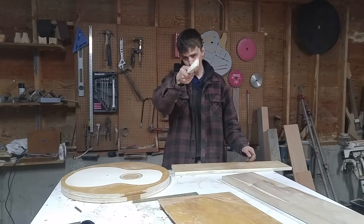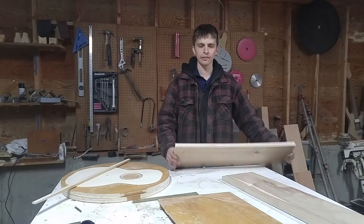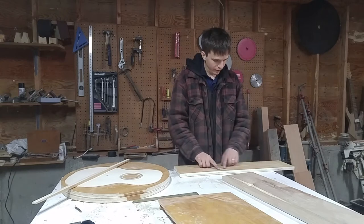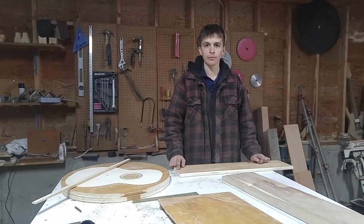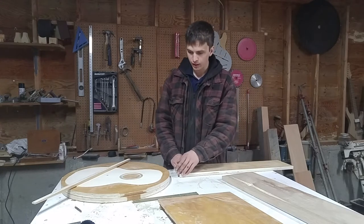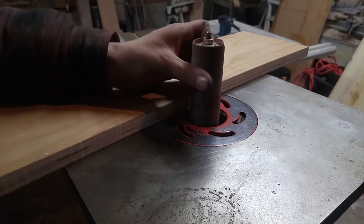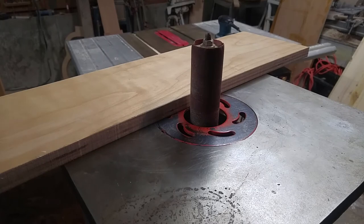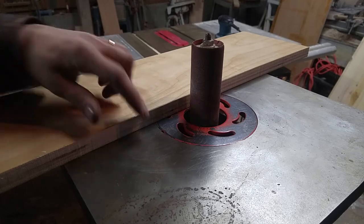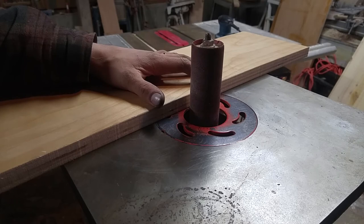I cut this piece here off at a 28 foot radius. So I cut it off on a bandsaw, got a haircut, you know. Now I have to sand the edge to make it the right size, and then I'll copy it with the router and I'll be able to make my dish. I'm borrowing this oscillating drum sander. This is just a nice little rig in order to be able to sand edges of things on a curve, and yeah, works pretty good.